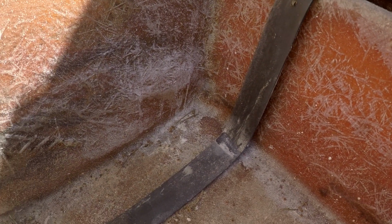These corrosion spots are from water sitting against the rubber strips. Any water allowed to sit against the aluminum will cause pitting. Here is where the tank sat in the rotted plywood drain. The stained band is where it sat against the stringer.